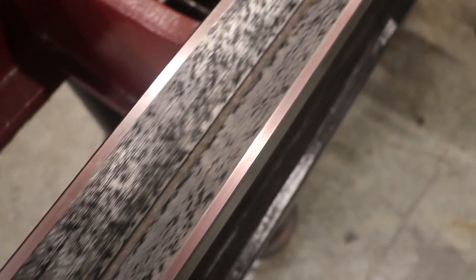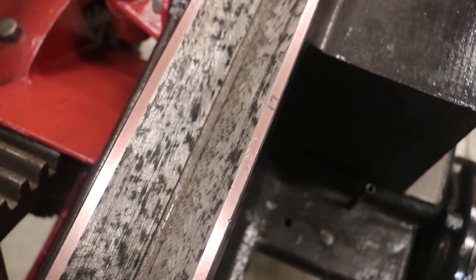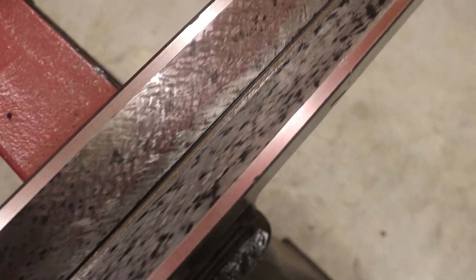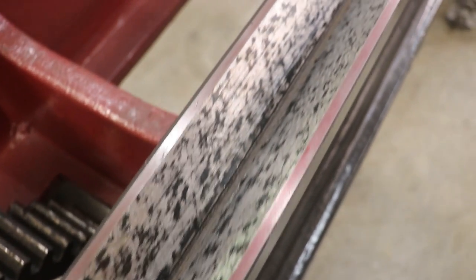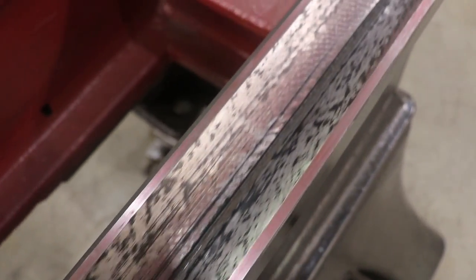Hopefully you can see both sides here, and I'm pretty happy with what we got. Remember that the table that rides on this bed is about eight feet long, and each one of those little dark spots is an area where we're making contact between the two. One of the things you want when scraping is not to have 100% contact from one end to the other, or you might get the parts to stick together rather than sliding. You want individual points of contact, and by breaking that surface up with scraping, that's what we're able to do — depending on your bearing, so many points per square inch.